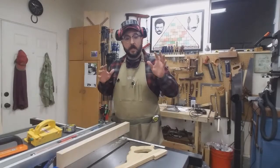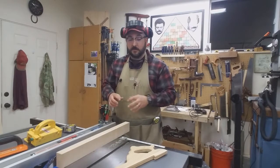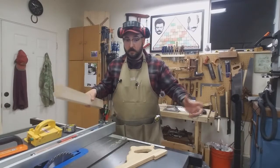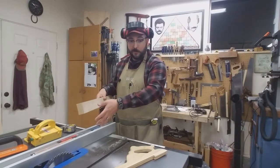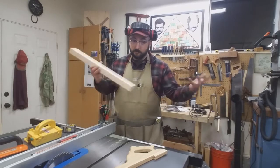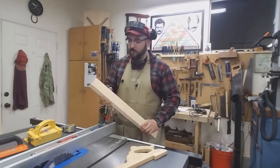So I know with my cartridge tins they're going to be pretty close to the original inch and a quarter thickness. You can do this any number of ways — I've got a thickness planer, I can do it that way; I've got a table saw, I'm going to do it this way; got a band saw, you could take this in on a band saw. You can also use a hand plane, tons of different ways. You could even use a rip hand saw if you wanted.